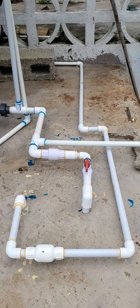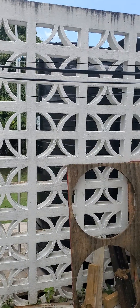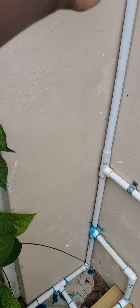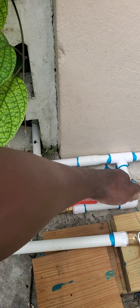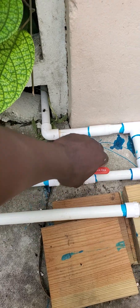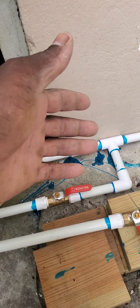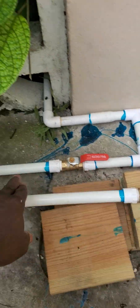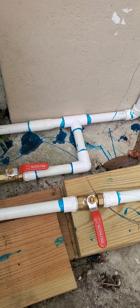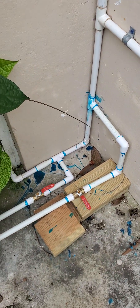Let's look at that — unique. I'm going to show you where both connections are: the one that fills the tank and the one that comes from the pump. The water tank is behind that wall and both pipelines come here. This is the main line — this is the connection where the water that fills the tank is connected. If you want to stop filling the tank, you just turn this off; to fill the tank, you turn it on. But you don't need to turn it off and on — everything should work automatically based on my setup. This pipe here is where the water coming from the pump enters the property. This is still off because I just did the connection and it's not fully dried — I'll give it some time to dry. That's where the connections are to the property.